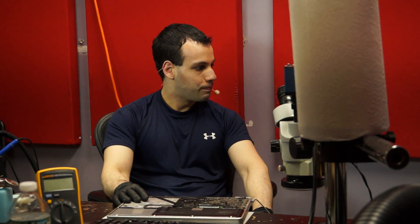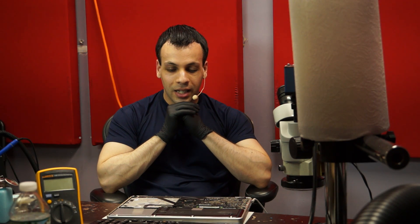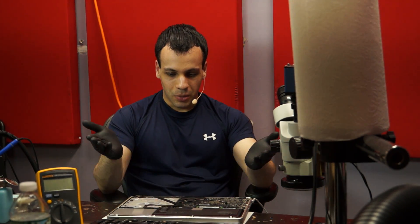You know why I don't do Lenovo ThinkPad repair videos? They don't break. But yeah, so I had a pile of stuff I was hoping to do board repair videos on and every single one of them was not a board repair. One of them kind of was, because it didn't work — I measured 50 kilo-ohms on the multimeter on current sensing where it was supposed to be two or three. Then I removed the epoxy, which has absolutely nothing to do with that, and it worked. So it's kind of like a lucky day. It's 3 PM — I guess I get to go home now. I haven't gone home at three o'clock since junior high school.